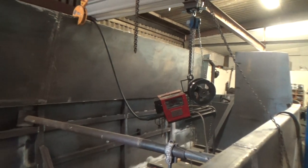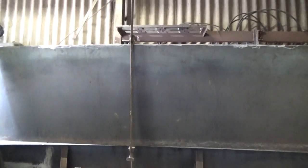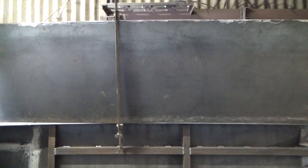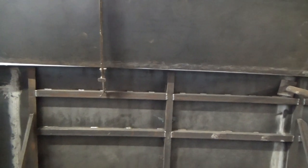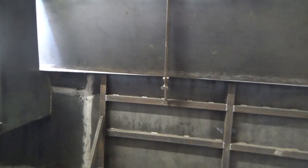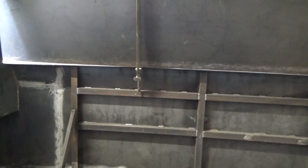That's what we like on the inside. I've come along up to here and the plate was lifting, so it's pulled to the outside edge. I've put a big clamp on it and pulled it down so we get less of a gap at the bottom. I'm going to get that all the way along — you have to pull that plate down. I'll stitch it on as I go; they're only tacks because we'll probably have to work the plate a little one way or the other at the bottom to get it nicer and in line.